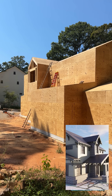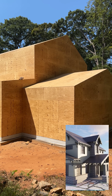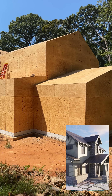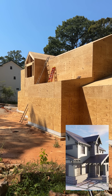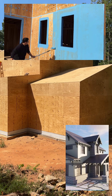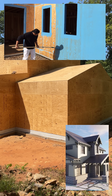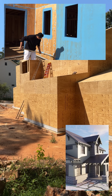This is half-inch CDX plywood that you're looking at, and you might notice a few things missing here — door and window openings and overhangs — and that's intentional. We're leaving all the doors and windows closed up because we want to install the WRB, which is happening starting tomorrow. It's a liquid-applied STPE-based water-resistive barrier.